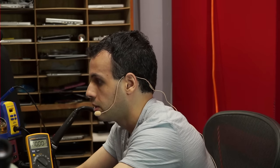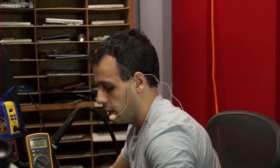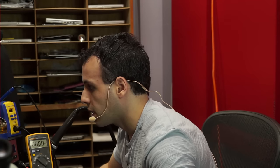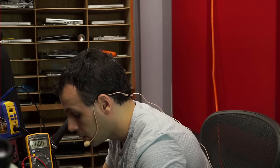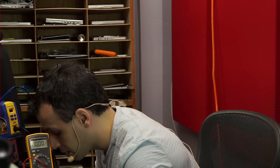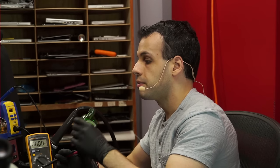We're going to check PP1V5S3RSO. I'm not sure if that's S3 or SO. What is S3RSO? Who the hell knows? 1.5. That's something to look up later. We're going to check you. And you're present on the other side of the board. That's fine. We'll still find you. You don't get to hide from me. And that is 1.49. Again, close enough. And since it's close enough, might as well reward myself with a little drink.